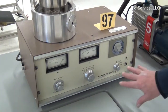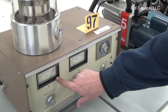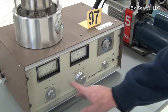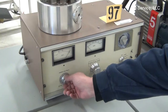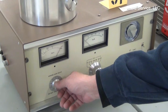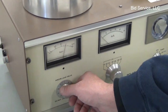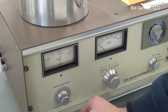I've had the vacuum on. The vacuum does come with the system, and we're at about 10 millitorr, which is lower than the expected value — it's normally expected to get to about 30 millitorr — so that's real good. I'm going to add in some argon into the chamber, and you will see the needle increase. I'll get it to about 80 to 100, and that's the normal operating range.